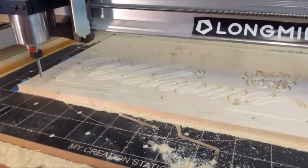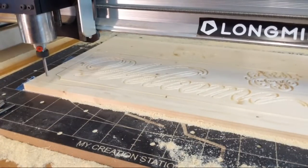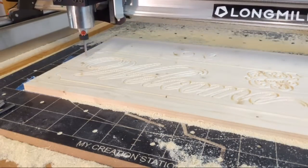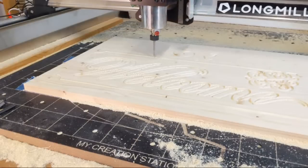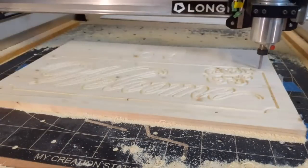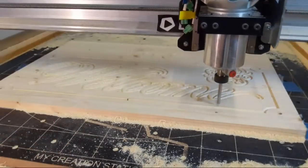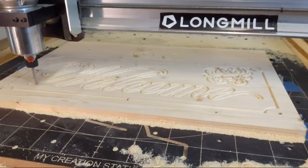Watch how fast this roughing bit goes. So a little bit of a stall there for a second. Okay, I know why that happened. I'm using a drill cycle, and I had a dwell command in there. And when you're using a drill peck cycle, I need to take that dwell out. It'll come down to the bottom of the hole and it'll dwell for a certain amount of time, which is what we set.